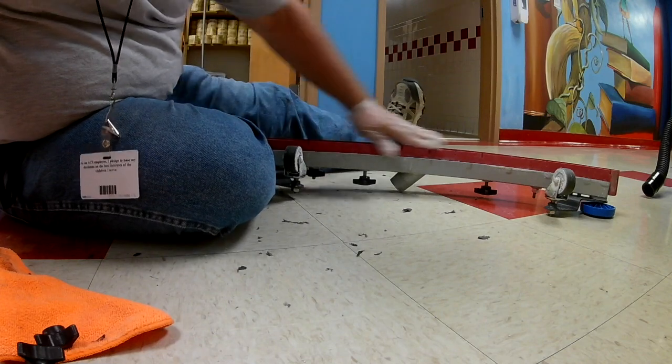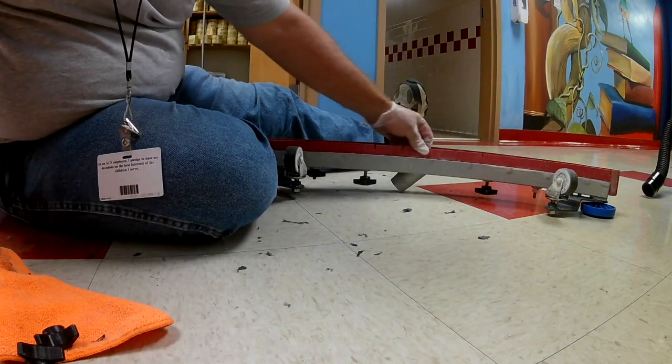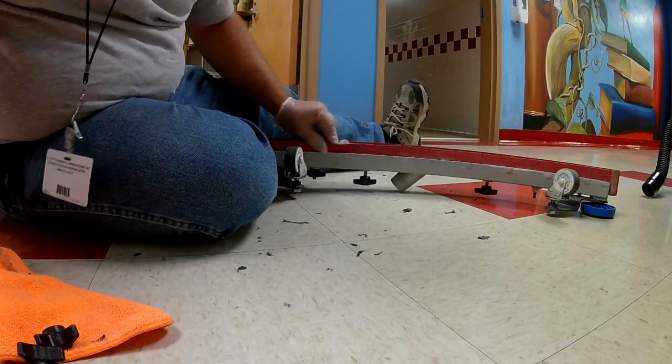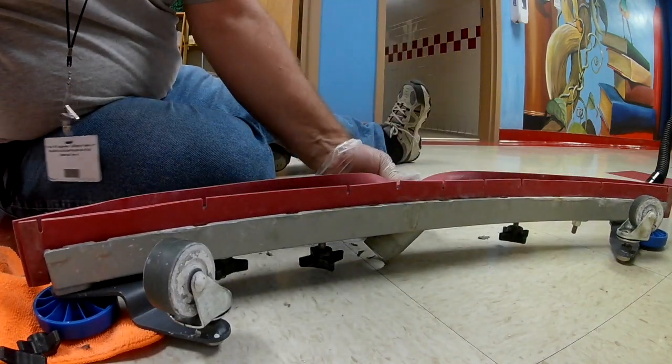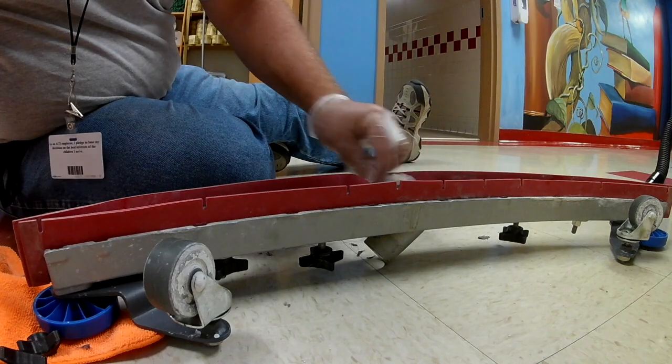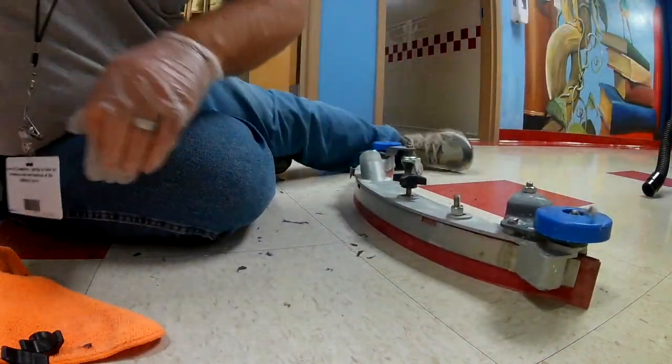Let's take a double look, make sure everything's lined up, and make sure the front squeegee is the one that has the little grooves in it, because that's where your water goes and your back squeegee catches it. Then let's get it back on the machine.